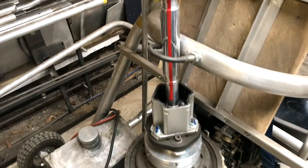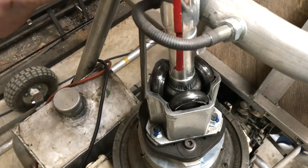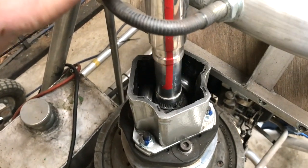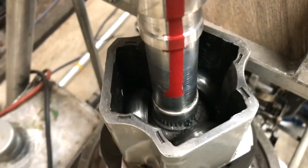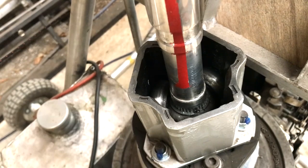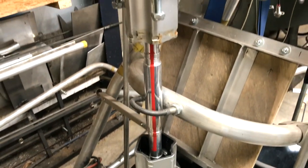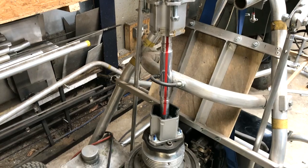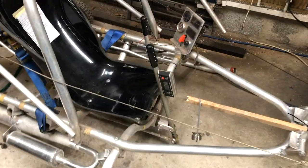These Audi A4 tripod CV joints are not intended for this application, and the rubber boots cannot take 6,000 RPM, so there are none on there anymore. I haven't got a solution to that as yet. What stops the joint coming apart is a swage in the female part of the housing, and it flexes in order to get the tripod bearing assembly out. I'm going to add some bolts in the housing to make sure there's no way of it coming apart. The red line painted on the shaft is just to warn me if any twisting has occurred after a test.